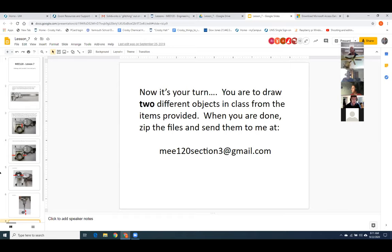I had a quick question before the test. Yeah, shoot, Sam. Go ahead. It's about the hole wizard feature on a cylindrical object. Yep. Is there a way, instead of making a tangent plane and then going all the way through, to start at the middle plane and then hole wizard in both directions? I don't think so. I have never tried that. I mean, I always just put a plane in. Yeah. Drop the hole wizard on the plane and go. Okay. I have to try it and see. It's not a bad idea.